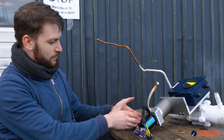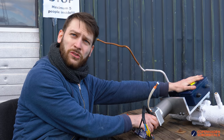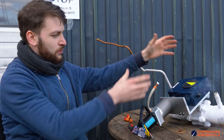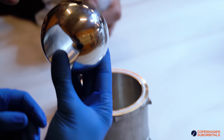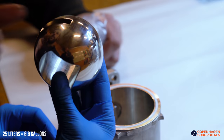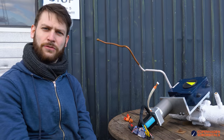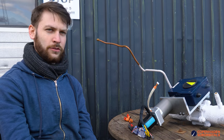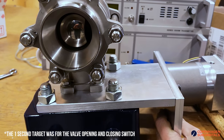As you can see, we have a motor driving an intermediate gearbox, driving an output gearbox connected to the valve shaft. This whole setup is there to actually be able to actuate the valve ball, which is approximately this size. It will channel 25 liters of liquid oxygen every second to feed the BPM 100 engine. It takes quite a bit of torque to actually open it up, and there was also a requirement for a very speedy opening of this ball valve — the requirement was one second.